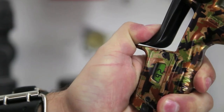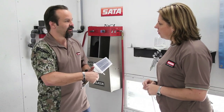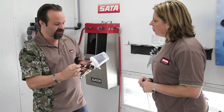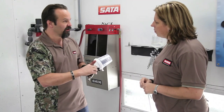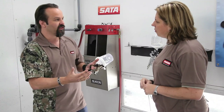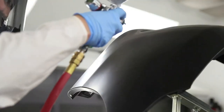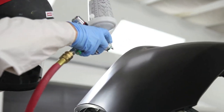On the spray guns we have either a digital gauge built in or you can run a regulator at the base of it. But when you restrict that down and start turning the micrometer down, it's just opening and closing a hole to be a pretty small hole. When you make that hole smaller — whether on a regulator or the air micrometer — the air speed increases to get the pressure needed to the front of the gun. If it's an HVLP gun I need 15 CFM; if it's an RP I need 10 CFM.